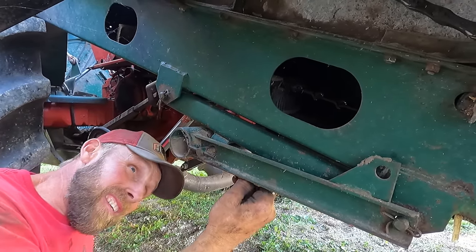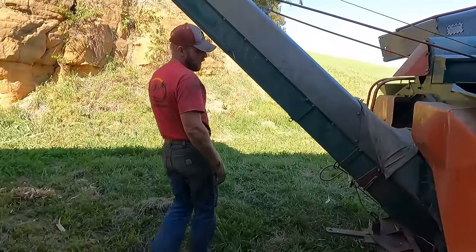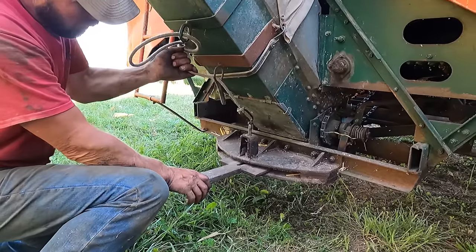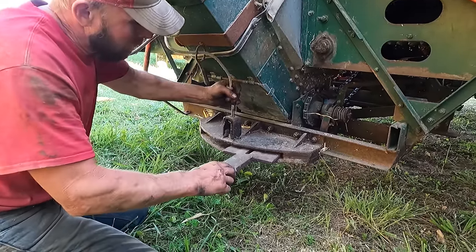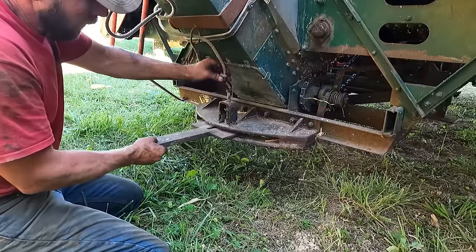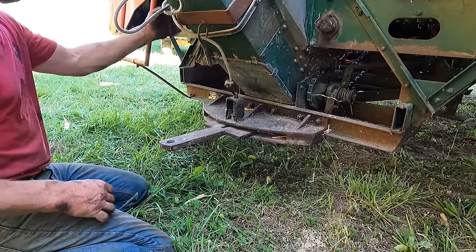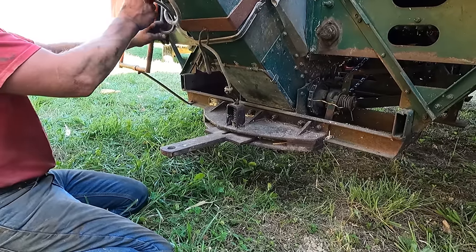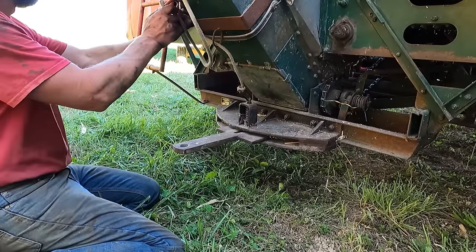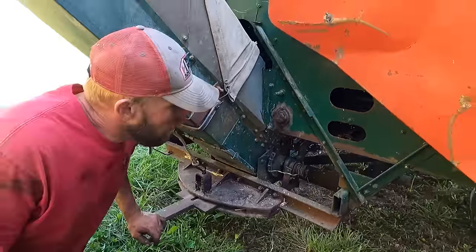And you have your key in back here so that it doesn't get dragged out by the corn stalks as you're driving along. Now this is something interesting for like a side hill, like opening a field. A guy made this. This isn't something that was bought, it was modified, where he could pull a pin and back up and get it to jump in over there, over here, or in the center, which normally you just have this part here going on under the machine. So that's kind of a nice feature. It's all done by a farmer. And here we get our rope pull for our pin. Some modifications.